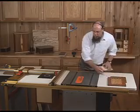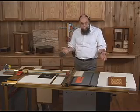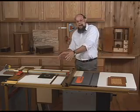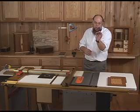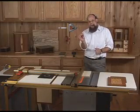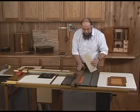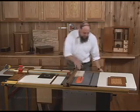The first thing we learn about using a saw is to plan ahead so that if you need a bunch of parts the same, you cut them all at the same time before you move the fence. That works great when the boards are wide, but for a project like that door where the parts are so thin, you'd have to set the fence up right on top of the blade to get the thickness that you need — and that's not the safest way to go about it.